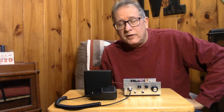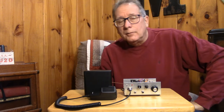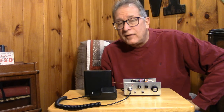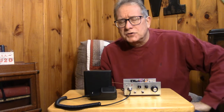Well, that's what it's like with a direct conversion receiver. Same thing. A lot of audio gain means the demodulation of extraneous AM signals that come in very strong. It's a simple thing for the thing to be affected by signals like that. We generally don't like to put a lot of gain before the demodulator.